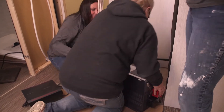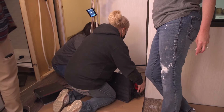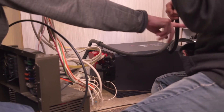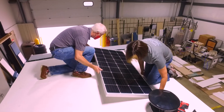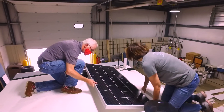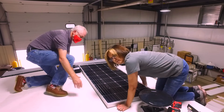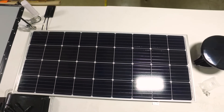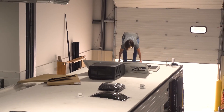It's awesome that we're installing lithium batteries in the Drive to Fab trailer because this inverter charger was specially designed to work with this new type of battery. Its charger is fully customizable, so it will work with a variety of lithium batteries, and of course it works with classic lead-acid batteries as well. One of the biggest differentiators with the EVO series is the additional DC solar input on all units — the installer can wire the solar system from the charge controller directly into the EVO, saving time and centralizing the power system.